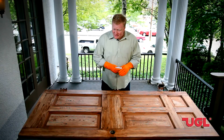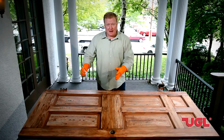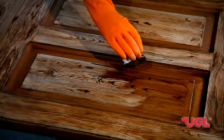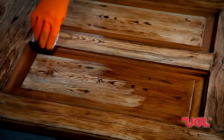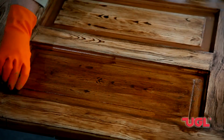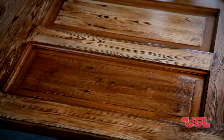Okay, we're back — it's been about two hours, and as I mentioned, I love this Zar stain because it dries really quickly. The next step is to take a soft cloth and apply a thin, even layer of stain over the entire door. I'm going to start with my inside panels and work my way out. As you can see, our wonderful grain pattern shines right through the stain and gives us that great wood grain effect. One more trick: if you have a door that is dark, just give it a coat of white paint or a very light color — a white primer or just about any kind of primer — before you start this project.